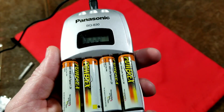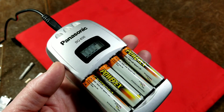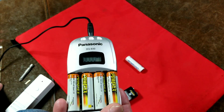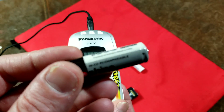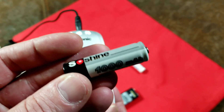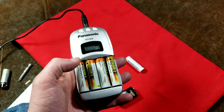I wanted to bring a review of a nice little battery charger, and the fact that modern rechargeable batteries are much different than the old ones. The pre-charged Eneloops really are great in any style. If you have super high-drain devices, there are some applications for NiCAD — nickel cadmium — and they still make them. They're about half the capacity of a nickel metal hydride battery, but these are the ones that can really take being charged super fast and immediately discharged and hammered over and over. Chargers like this will be compatible, so you can buy one charger and use it with whatever batteries you have, then buy really premium batteries.